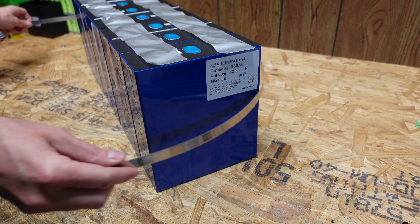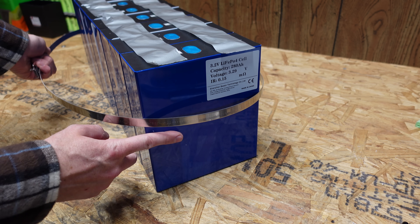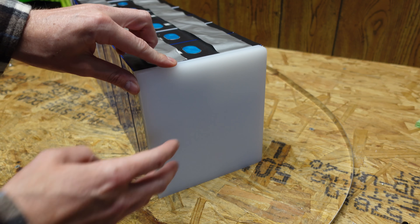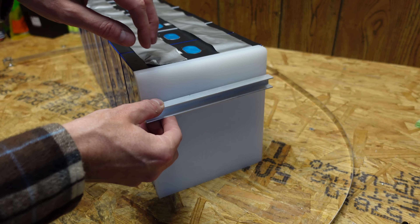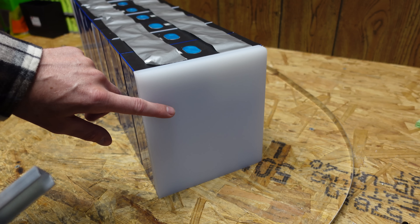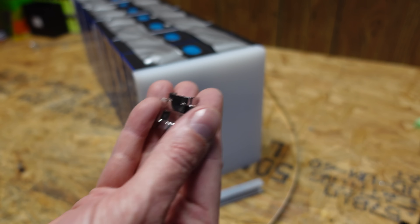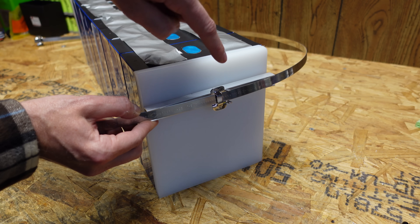There are a few more things to consider. I can't put this strap directly around the batteries because I cannot have this metal cutting into the case and shorting out the casing. So I have a piece of cutting board — half-inch thick, nice and strong, doesn't bend easily — and I'm going to put one at each end of the battery pack. Even though it's strong, it's not immune to being punctured, so I'm also taking a piece of half-inch aluminum U-channel and putting it up against here. This is cut just a hair longer so it overhangs the batteries, meaning the strap is not resting directly on them. The U-channel sits across the end, and I'll have the strap passing through it. Additionally, to help spread the compressive force, I'm sliding in a second buckle so the force is exerted from each corner along with the center — providing three clamping points across this board.